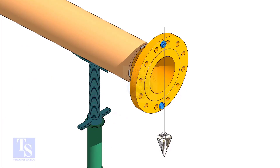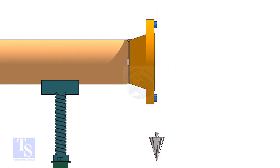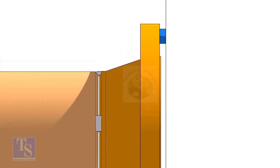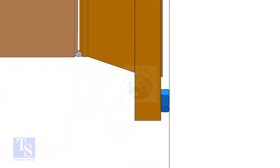Level the pipe. Put a plumb through the center of the flange on a nut. Use another nut of the same size to measure the gap between the flange face and the line thread of the plumb. Rotate the pipe and the flange 90 degrees and check the plumb again, adjust the gap and maintain the plumbness, and complete the tacking.